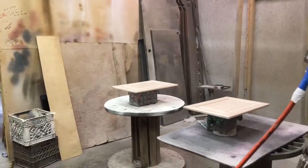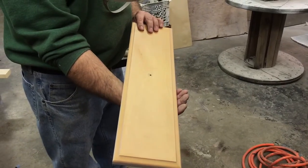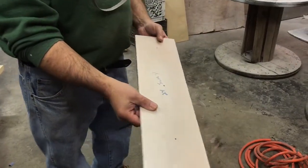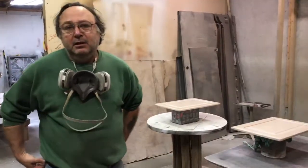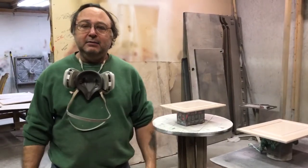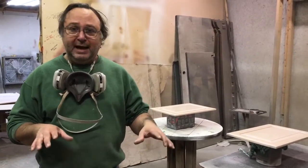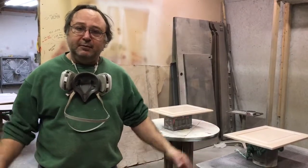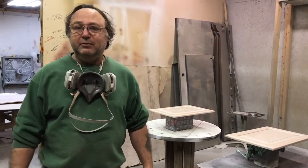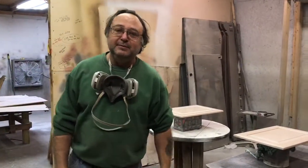You can see how that kind of flipped it around — it's amazing how you can take that yellow maple and cover it up. You can achieve this by staining your stuff too, but if you stain it you've got to let the stain dry 24 hours and then the stain bites in. We're dealing with maple, so you get blotchiness. I found that gun shading works wonderful for me. Everything that leaves Timeless Arts Refinishing is all gun shading — it's the quickest route to go. There you go — it's a whitewash finish on maple doors. Thank you.